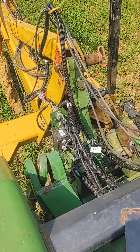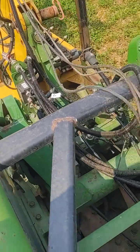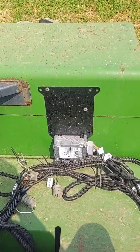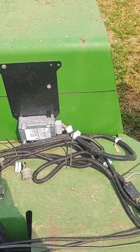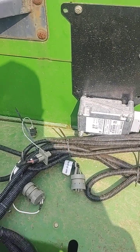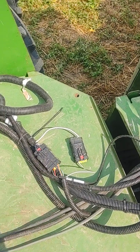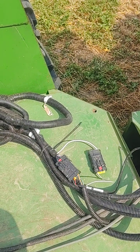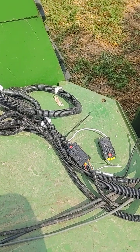From back here on our ISO connector we have our Y-harness for our UCC, or i-grade controller. All the harnesses come back here, and on this machine it's pretty open, so we have the i-grade controller connected here with the constant power harness plugged in. We don't need the feedback connector hooked up because we're using the external SCV. This plug has our serial port adapter for the Terra system, and it's also the same plug that uses the external valve controller for the external valve on the tile plow.